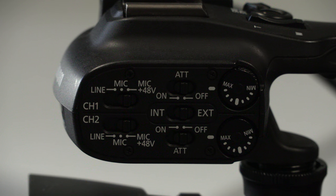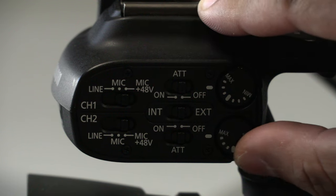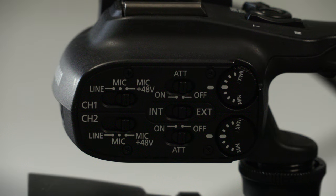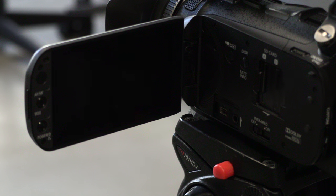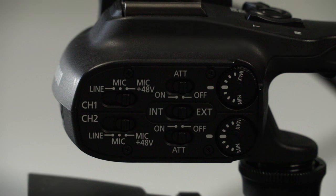We need to set up the options on the preamp. Make sure first that the external preamp is on — you do this by selecting EXT, short for external. If you use INT, that will use the internal microphone, which has terrible audio quality. Make sure for input 1, you set it to 48 volts — that's for phantom power and that's what powers the microphone. Next, set the attenuator to off. An attenuator is used to turn down a really noisy signal, so by using headphones you can check on your noise levels, and if you find that you're distorting, go ahead and turn it on. As with all things production related, you'll have to adapt to the environment you're in. Use the dial wheel on the side of the camera to adjust the recording levels. Be sure to plug in your headphones first so that you can hear what's going on — do this before you start recording or you might ruin a great interview. If you're planning on using a wireless mic kit, use just mic, because the wireless mic kits have batteries and the 48 volt phantom power will cause interference on the transmitter and will ruin the audio. If you're recording directly from a mixing board or a pool feed at a press conference, use line.